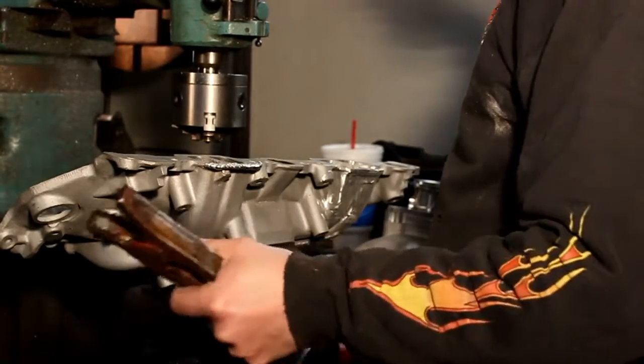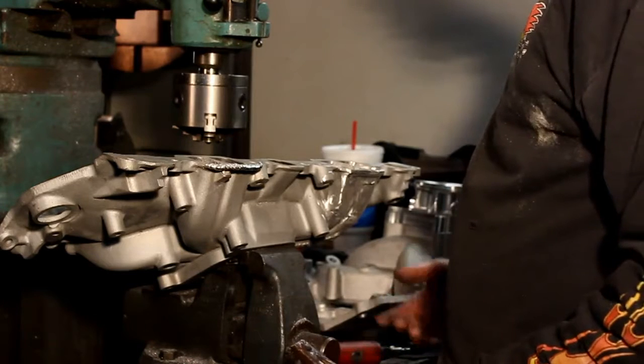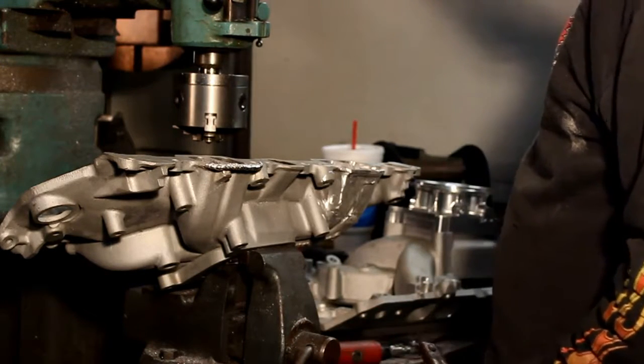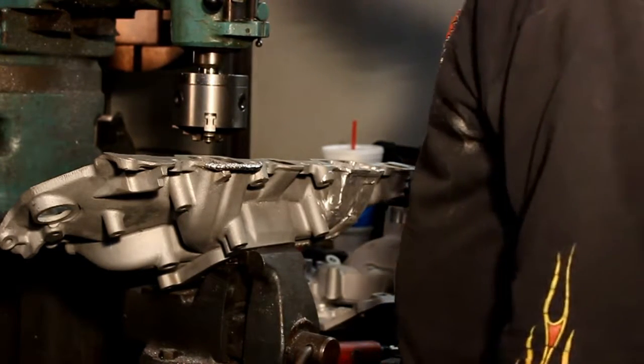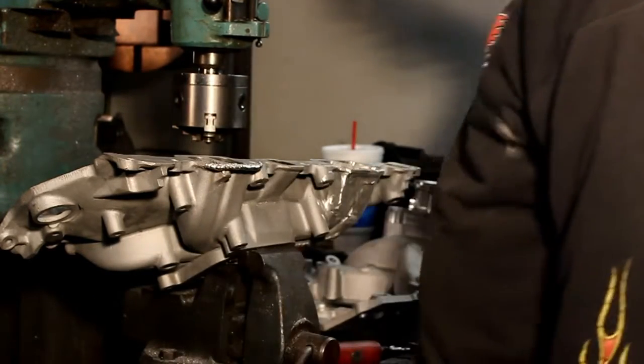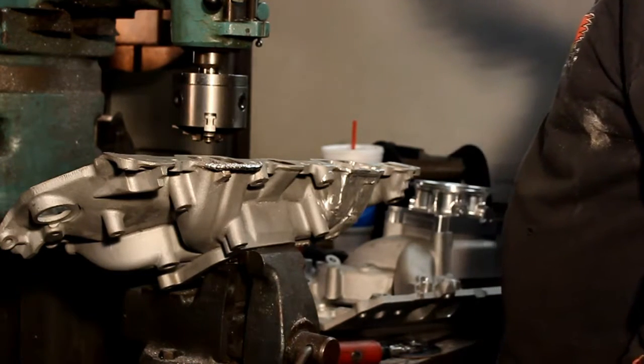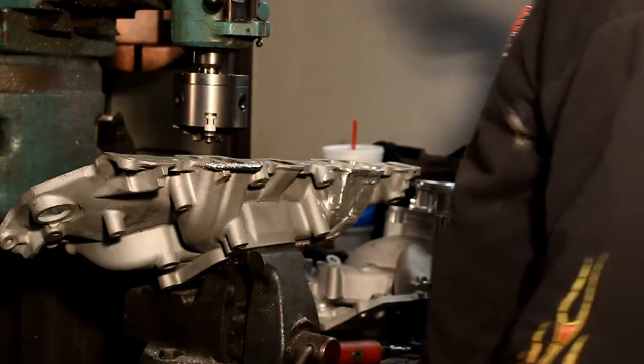One quick thing - I don't know if you noticed, but I have this clamped to here. If you're like me and you use your bridge port as a workbench, just make certain you don't clamp your ground to the handles, because then you may destroy your bearings - or in my case, my ground ball screws.